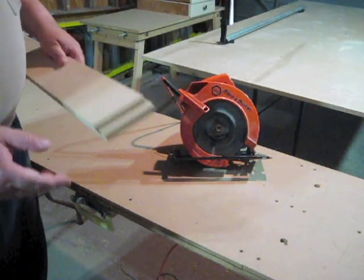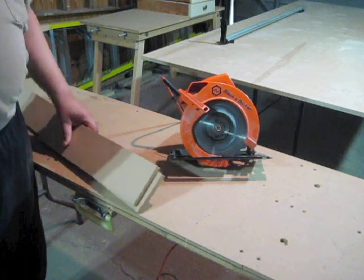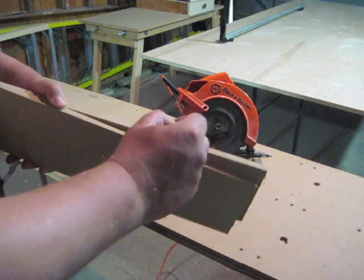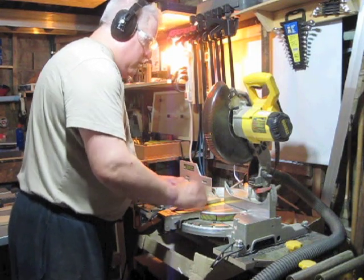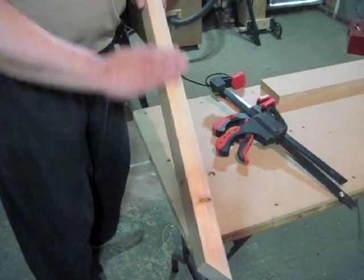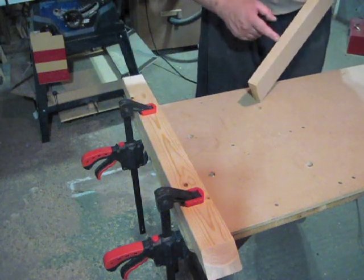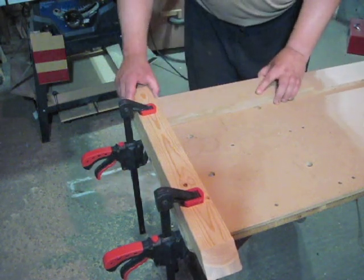First thing I want to do is take these pieces over to my miter saw and make some nice, clean cuts across the end. To make sure I keep things oriented all the same way, I'm going to make a little mark on this edge so I'll know that was the side that was up against the fence. Then I've got a nice straight piece of 2x3 that I'm going to clamp down good and tight to the table. Next, I'm going to take my two boards that I squared the end on, make sure the reference lines are in the same place, and clamp them to the table nice and tight against this board.